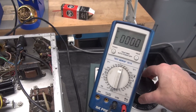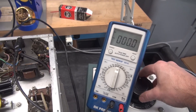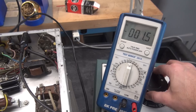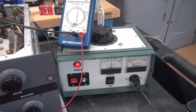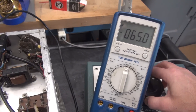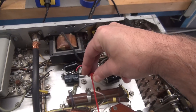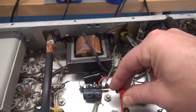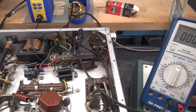We're hooked back to the variac. I'm not going to turn on the plate switch — just bringing up the variac and looking for voltage on the new caps. First I'm looking at the negative DC voltage. At about 50 volts in, nothing yet. Taking it up to about 80 volts input — this is the value of the variac, people; if you're going to work on this stuff, you've got to get one of these. Here comes the negative voltage — good sign. The negative is high because the modulator section has been disabled. Let's also verify the low voltage DC is present on both sides of the choke, which has been replaced. Good to go.